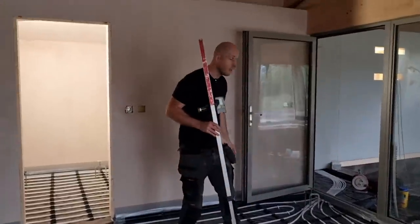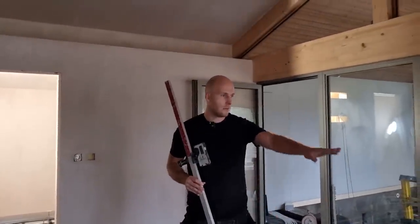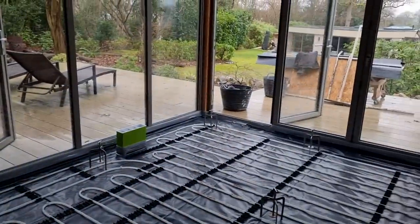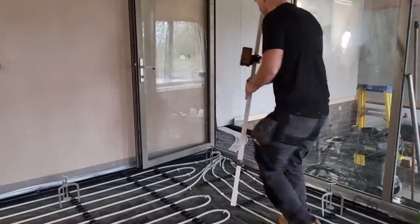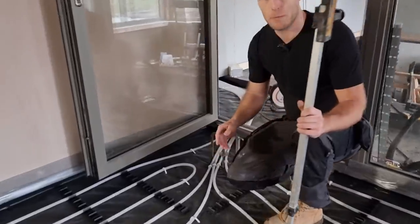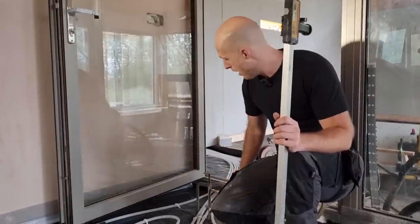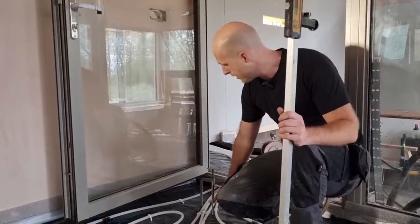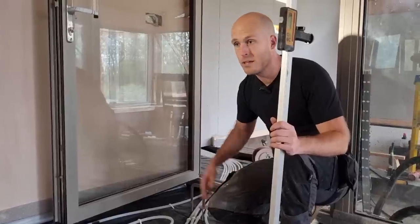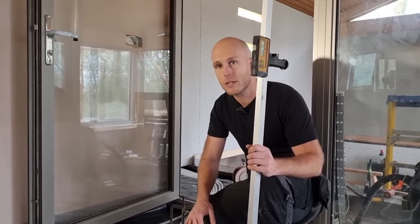So how's it going, James? It's going well, yeah, levels are good. Are they? We've taken 50 mil across the edge there and just leveled that across the whole floor. Brilliant. So yeah, all good. Show me how the tripods work. Tripods, we call them. Yeah, so all we do is we set this basically as our datum. We'll come into a job, the customer will have a datum on the wall or a level they want to work to in terms of their door. We'll set the top of this disc to that level, and then simply with the laser and the staff, we level every disc over the whole group of tripods, and that's what we fill up to essentially.